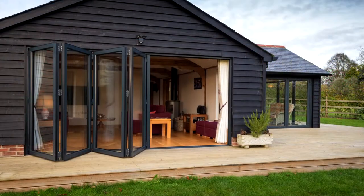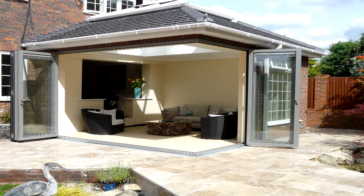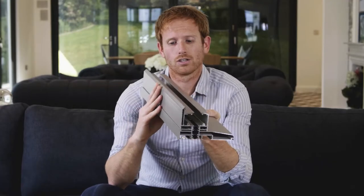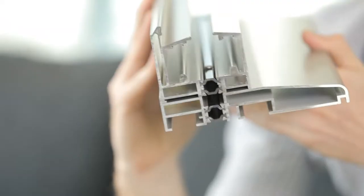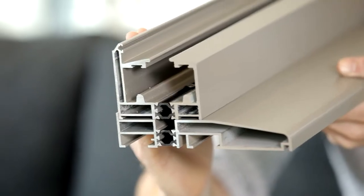This is the only way you can truly be sure that your house will be safe and secure from leaks and draughts. The second step is to speak to your architect or builder and ensure that your threshold and drainage system are sunk into a channel such that the base of the threshold is 47mm lower than the internal floor level.